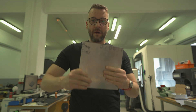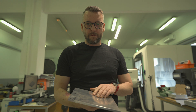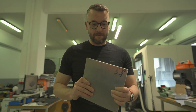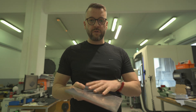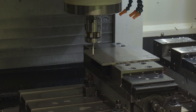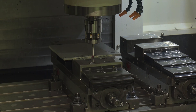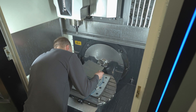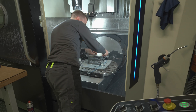The first thing we're going to do is take this piece of aluminum and make the base plate on which we will mount our motherboard. This is a fairly simple piece, however it does come with a drawback — it's very thin, which means we're going to have to use vacuum in order to mill it properly. Before we can do anything with our block of aluminum we need to align the machine's coordinate system with the dimensions of the block. Once that is done we mount the block onto the machine and turn on the vacuum which will hold it in place while milling.